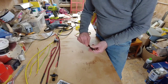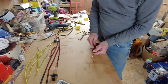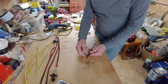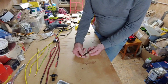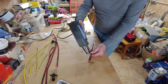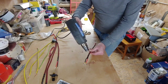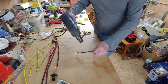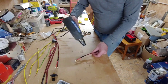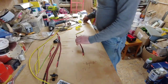Pop this over. Now I'm going to leave a bit of cable inside the plug part, inside the back plate, the back box I should say, because if we want to service it anytime, we want to be able to get it out, and it's easier to do that with a bit of cable left behind it, so it's not too tight. We don't really want it too tight. Tickle it in from afar, don't go too close with it, otherwise it'll melt it. There we go. Right, so we've got it to that. So now we've got our shortest length.